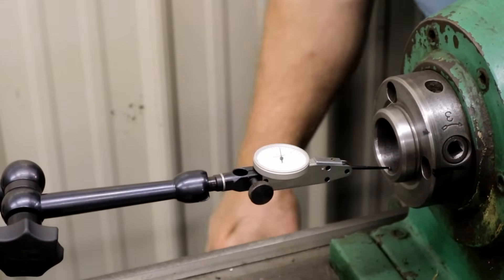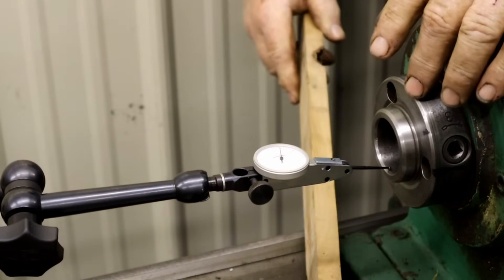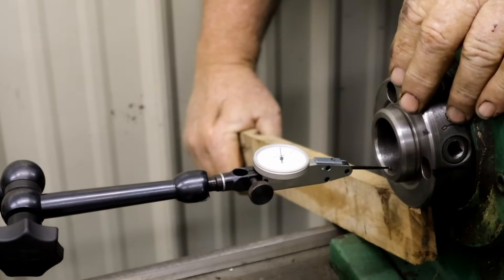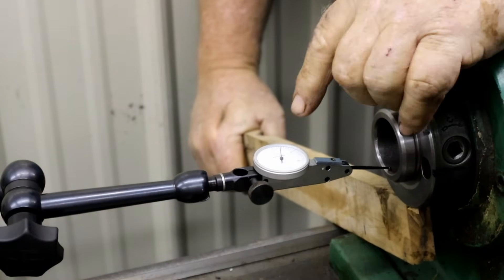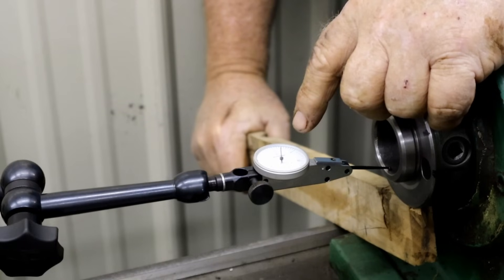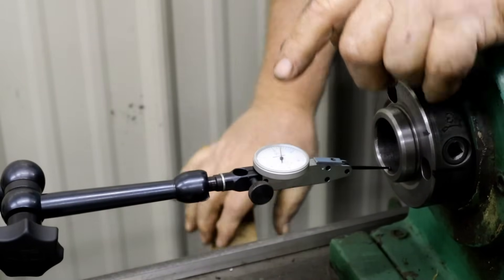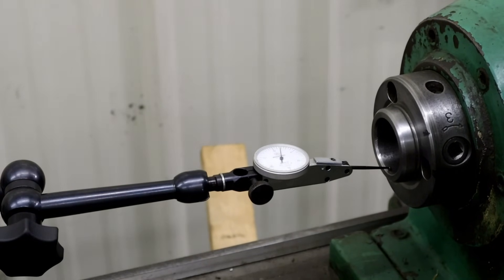While we're here, another thing you check when you buy a lathe is to see if there's any play in the bearings. You put a board — usually a two-by-four — underneath and lift up. I can barely lift this thing even with a lot of pressure — maybe three ten-thousandths. If I saw that on a regular lathe, I'd be happy. Now let me move you to the other end.